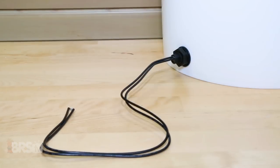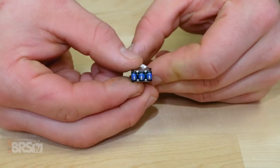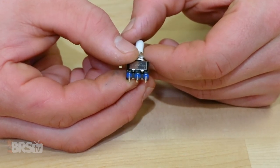As you can see, the switches we're using each have two wires which will be split between the ground and one of the numbered inputs. The only exception is the three-way toggle switch, which has a single ground in the middle and two separate on wires — which you'll see why in a bit.